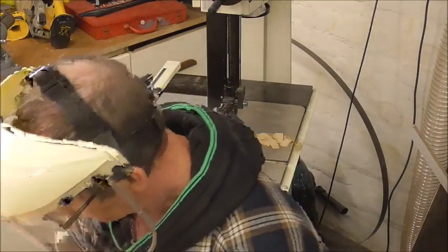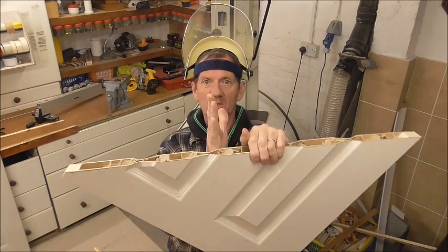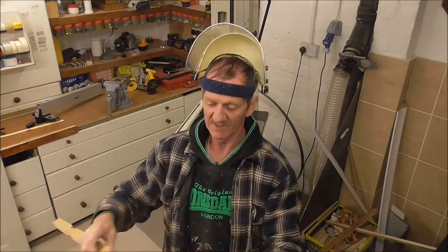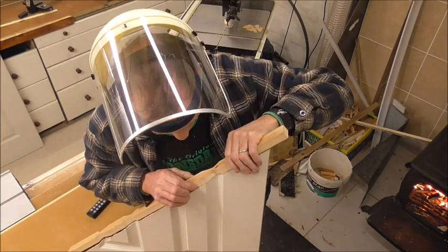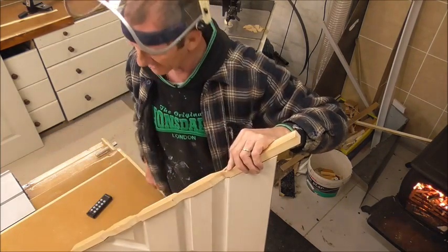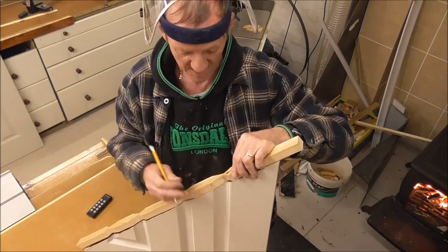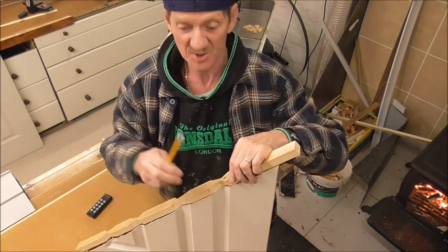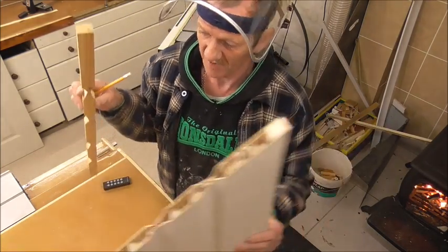If I need to adjust it I can do it. Now the next issue is with the slope. Obviously we've cut square but we're going sloping, so we can't push it in - especially on the back sides - when the slope is the wrong way round. So we need to back up that side in order for it to go in on both sides and get it straight. Bear in mind when you're doing this where this is going - it's not going onto the sample piece, it's going onto the main door. If you've cut everything to fit this sample piece, you will be upside down. So at this point, put away your sample bit and go from the door.